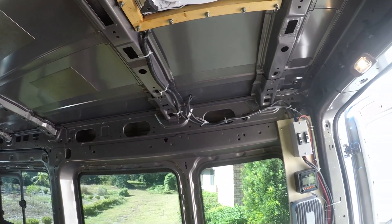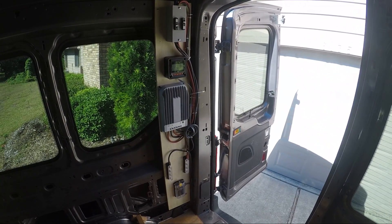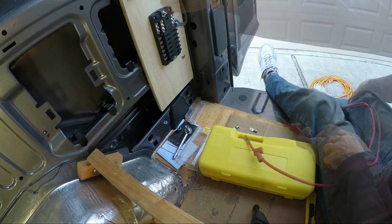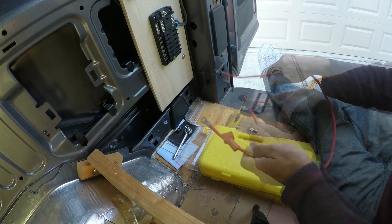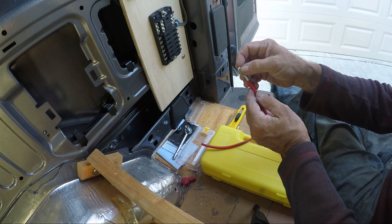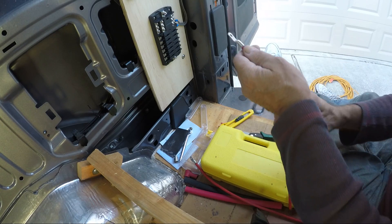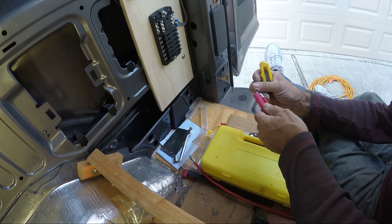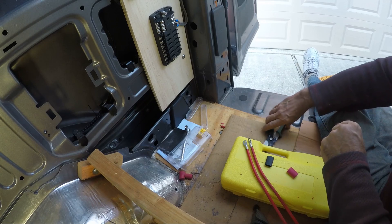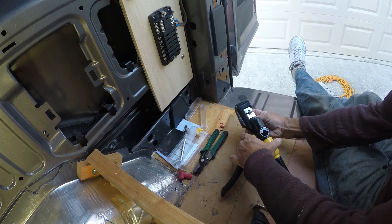And that's the way it looks now. What I'm going to do is connect the fuse box with the bus bars. Again, this is just a temporary installation and I'm using an old cable. I'll cut it in half — this is an 8 gauge wire. I'll be putting a lug on this side. That one fits well too. Then we need some heat shrink on the two red cables, where at least one indicates it's negative and the other is positive, and I'll just close it so the lug is just holding in there without being depressed.